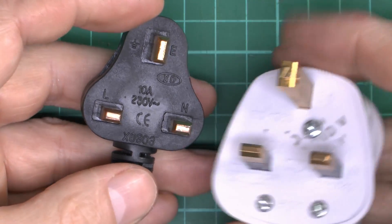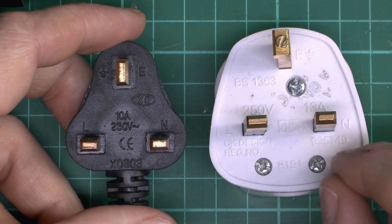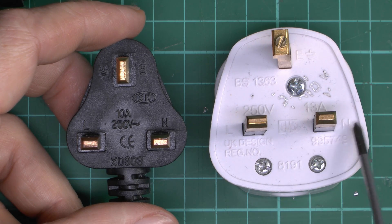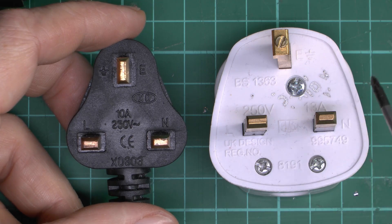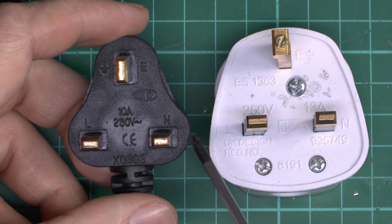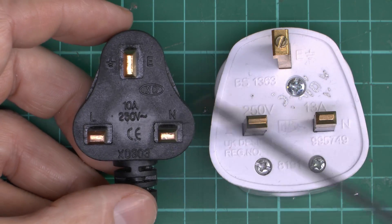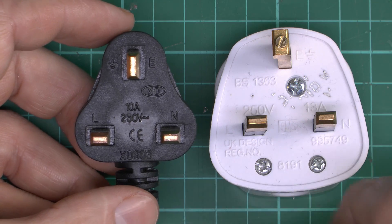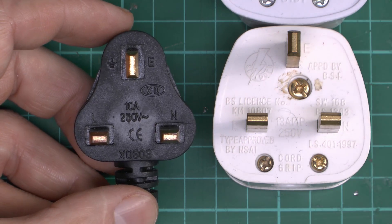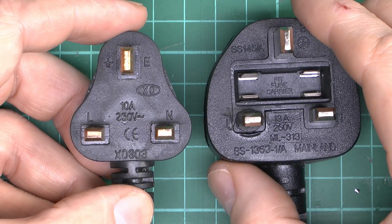If we bring in a normal sized UK plug, you can see there's a dramatic difference in size. This is the actual proper size. An important feature is that there's supposed to be a certain amount of space between the edge and where the actual pin is — there are minimum dimensions on all of this. And you'll see this one falls way, way short because there's almost no space on the two edges. The whole physical dimension is massively smaller. And it's not just this plug — they're all basically in that same size realm.